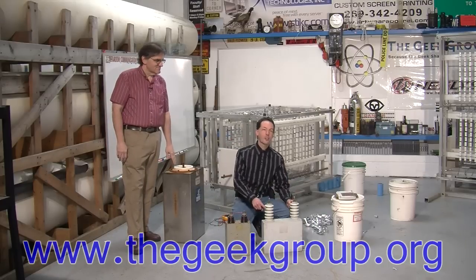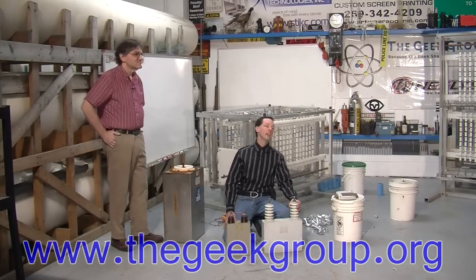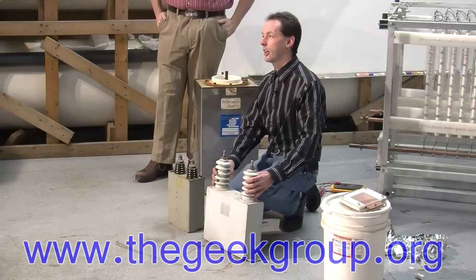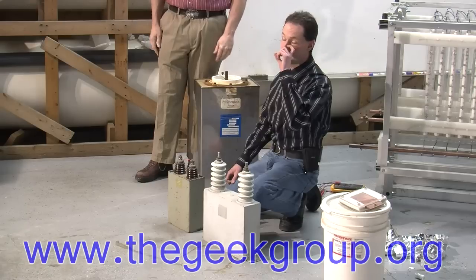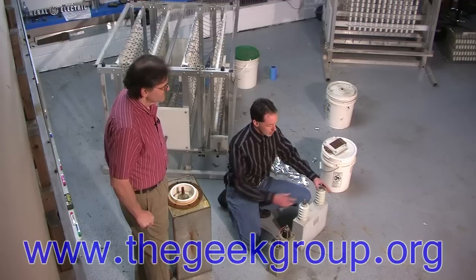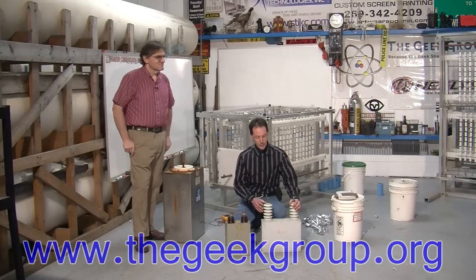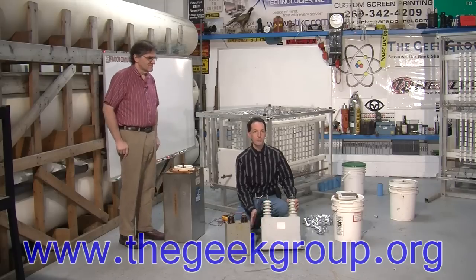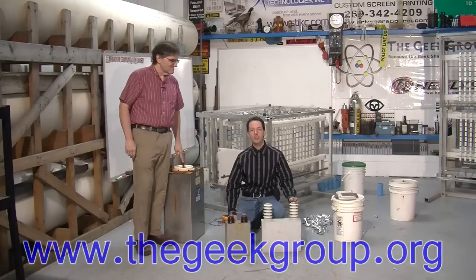This is useless as a pulse capacitor. You will see these all over the place. In fact, we have a member on set right now who bought one of these. Hey, Chuck. Where did you buy your PFC cap? Ben Harper. Okay, you just bought it like in a surplus place or something? Right. Okay. And Chuck's far from the first person I've heard that did this. People buy these all the time because they show up at surplus a lot. There's millions of these out there. And people buy them thinking they can use them for their Tesla coils, and you can't.